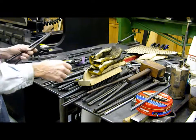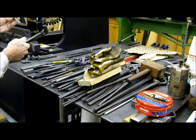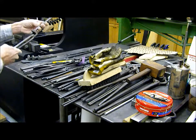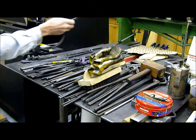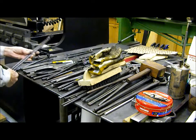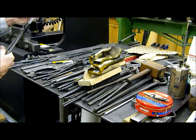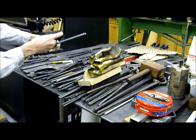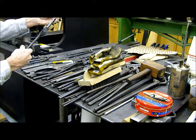Today I'm going to be using this pair of tongs I bought from GS Tongs out of Taiwan. He's got a YouTube channel. This is specifically for 3/8 inch stock, and every once in a while I'll need to fold the flat section, so I'm going to use these tongs here. They're basically flat tongs with a nice little recess indentation in the jaws.